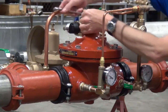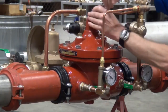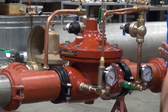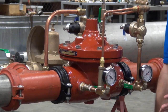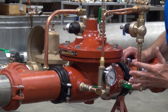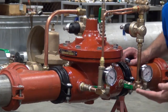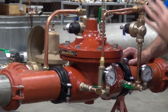I've got an inlet shutoff valve cracked and we're just pressurizing the valve and filling it for these bleeding procedures. Downstream, we have no water flowing at this time. Now, the next thing we're going to do is set the valve's pressure while it's under flow — it's imperative that we do this. If you don't, you'll find that you'll get chattering, shaking, etc. The valve doesn't know whether it should be open or closed. So it's imperative that whenever we set a pilot-operated pressure-reducing valve, we do so while it's under flow.